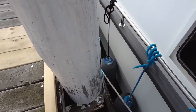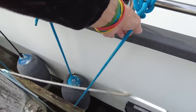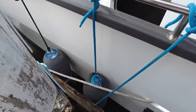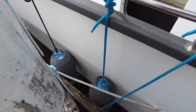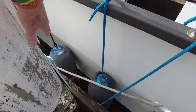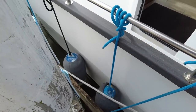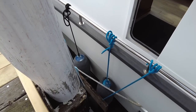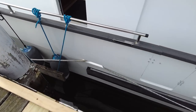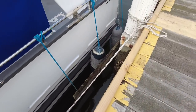You can see I've got fender boards rigged down beside the boat. The fender boards come up onto this line here — that's tied to the board — and then my fenders are in behind the fender board. What that does is it allows the board to rub up and down against the pile, and the fenders keep everything off my boat. So that's how fender boards work — one at the front and one at the back.